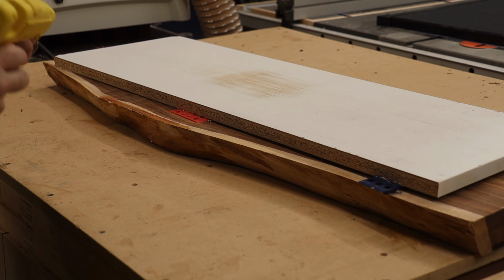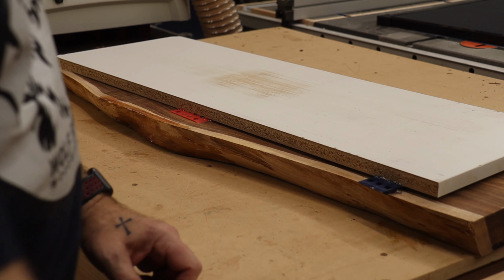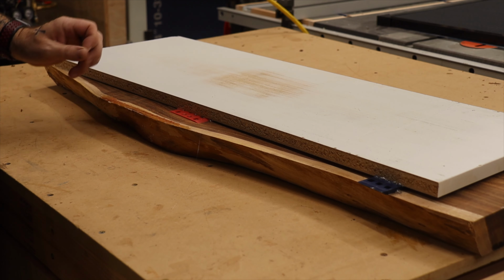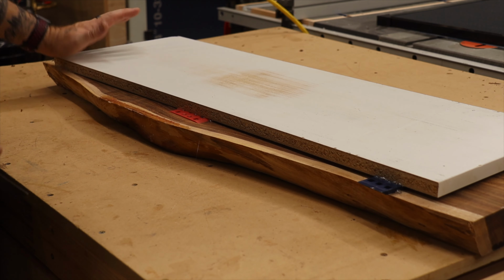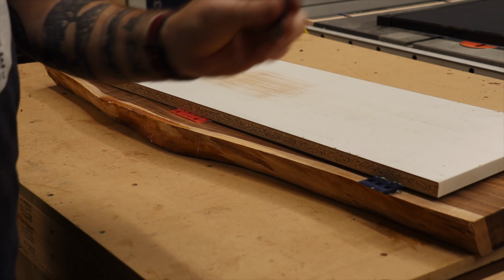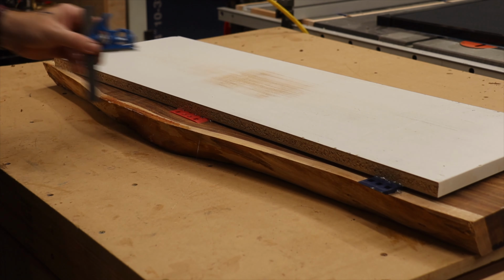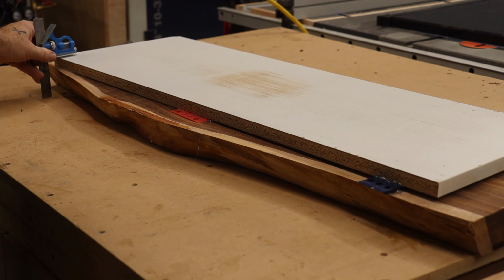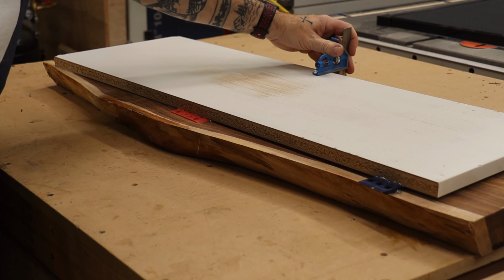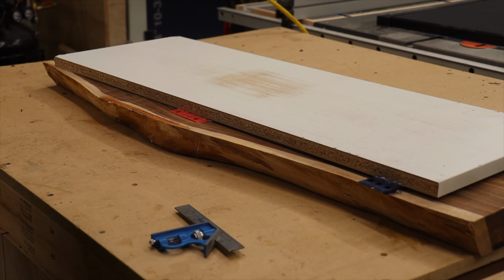And we'll give that just a minute to cool down, and then I'll get the drum sander set up and we'll get this thing sanded. The other thing you want to do before you send it through the drum sander is figure out where your high side is, because what you don't want to do is say this is your low side, set it to that, and then come to find out this is so much thicker that it gets bogged. So what I just do is put this on there, and I know this was the high spot because I just did it, but you basically set it there, come here, and if you find a new high spot, then you just go with that. All right. So just right at 3 inches, and it should barely fit through here.